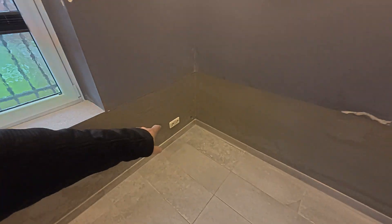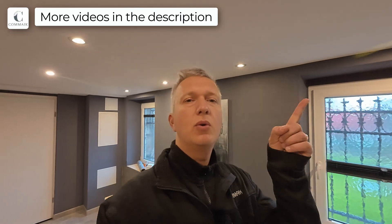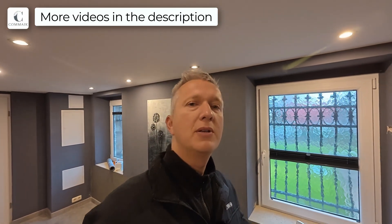The basement I'm currently in belongs to a house that was built in 1900. The walls are extremely thick and made of brick, but unfortunately there's no proper foundation. I drained the area around the house, installed drainage, and prepared and dried everything as much as possible. Inside I installed a new horizontal barrier to minimize rising damp. If you want to know how I did all of this, take a look at the top right corner where I'll link you to the videos for this project.